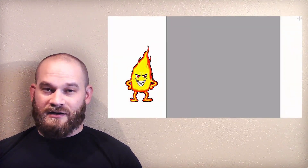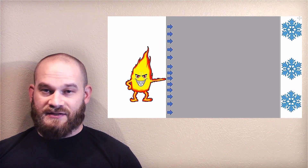You may think of concrete as a dry dense solid, but there is actual water inside of concrete. Let's check out this animation. The fire will heat the surface of the concrete and the water will begin to expand and migrate away from the heat source.